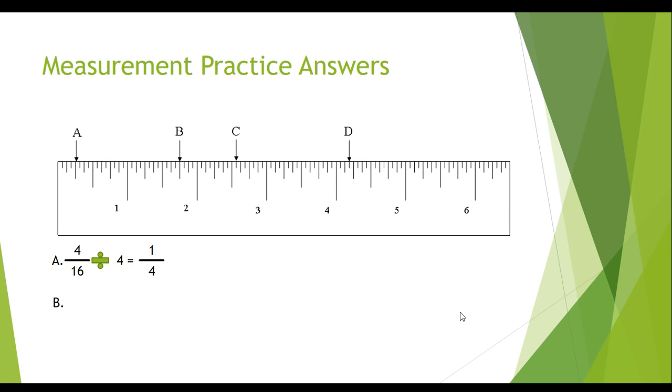When we go to B, we notice that the measurement is past the first inch. So remember, we always go back and write down the previous inch — in this case, we write down the number 1. Then we'd put our 16 with our fraction bar. To get the top number of the fraction, we'd start with the first small mark after the inch line and count each mark until we get to where B is pointing — in this case, it would be 12. We write the 12 on top of the fraction, telling us we have 12 out of 16 equal pieces.